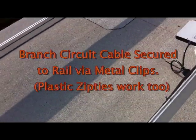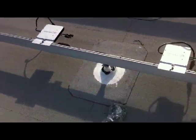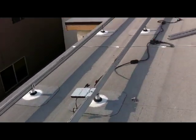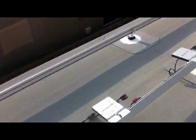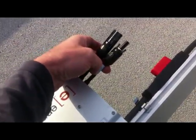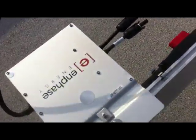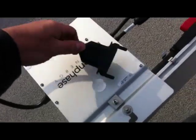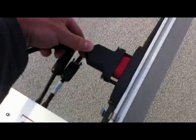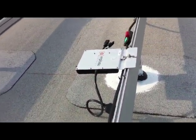Once we've done that, the next step is to drop in all the panels. They'll attach onto the rails with the rail clamps — end clamps and mid clamps. The back of each panel has your DC positive and negative, which attaches to the MC4 connectors off the panel. This inverter will change that DC into 240 volt AC right at the panel level, and then they'll all plug into the trunk cable, which will feed ultimately into our main panel.